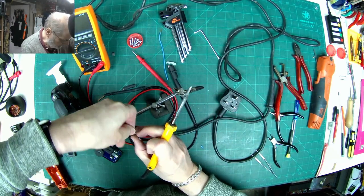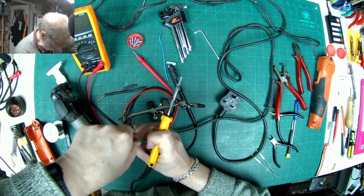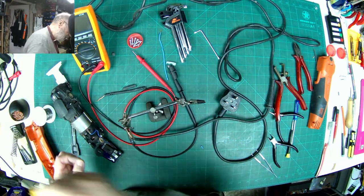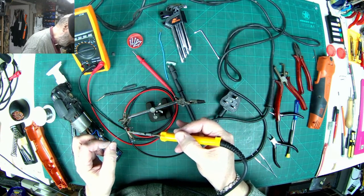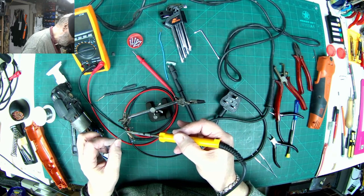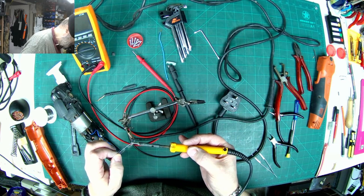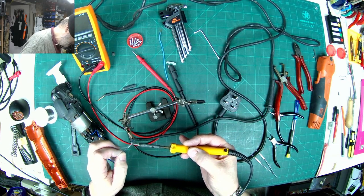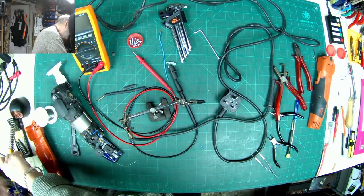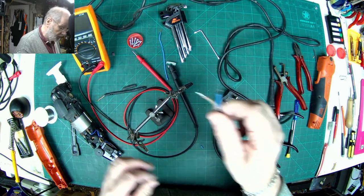And we'll just make sure that wires are twisted firmly around in the way that they came through. And then we'll just, with a clean soldering bit, just heat the wire up and make sure we've got a nice flow of solder onto all of that. Do the same there. And that just keeps the wires together, makes for a nice solid connection when I push that into the connectors.